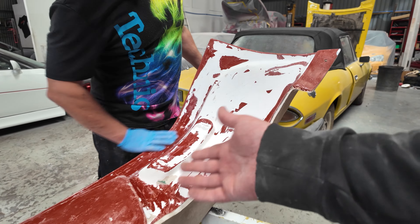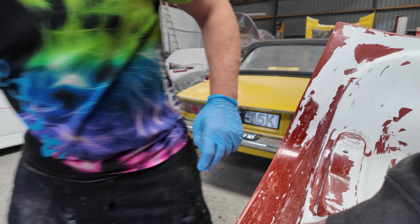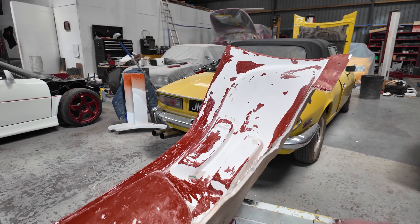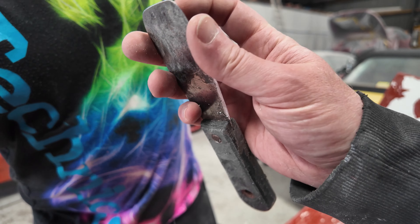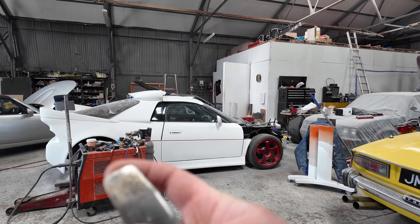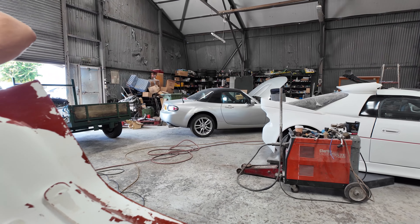If you can see it in the mold, you'll see it in the part produced from it. If you're going to wet sand it, use 2000 grit — no less than that. It is what it is, just try and keep it to a minimum. If the scraper blade has got a rough edge on it from scraping the wall, clean that up with a bit of 2000 grit — take that roughness off. Clean those sharp bits on the corners up so they haven't got rough edges and it'll work a lot better. That's partly where the scratches are coming from.